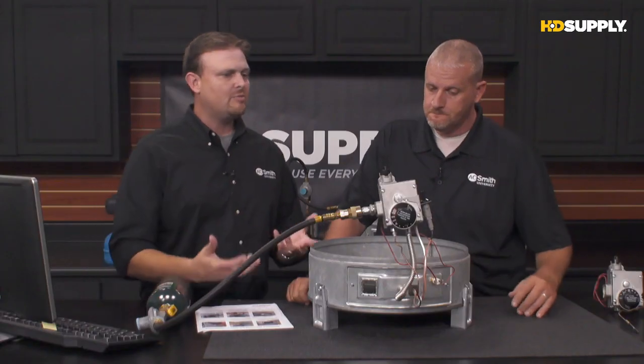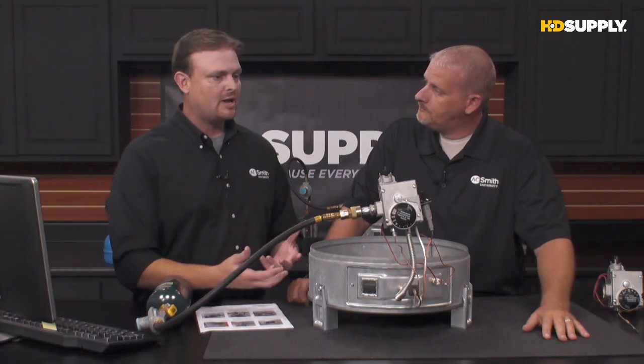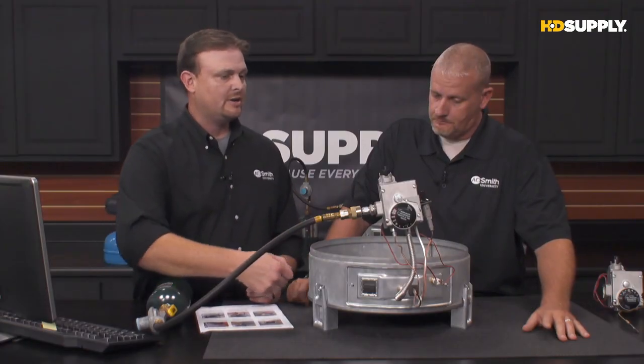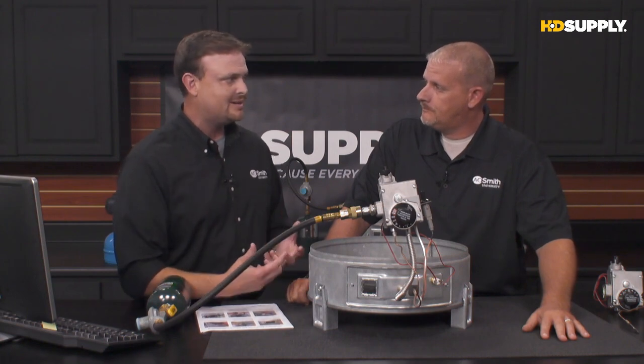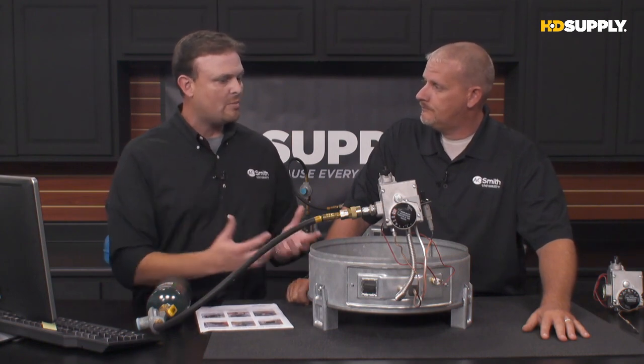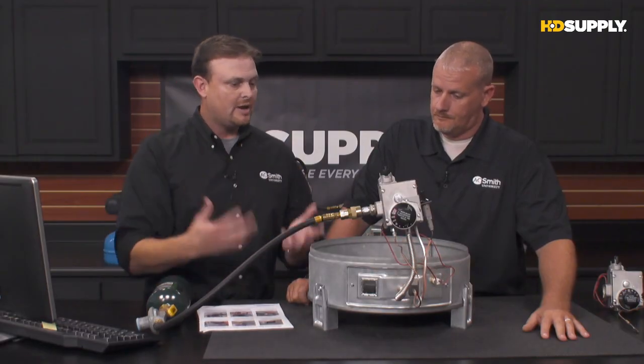If that happens, then you know it was tripped and now it's been reset. Okay, but let's say for our purposes we try to relight it, and we're holding it down, and we release it, and it goes out, and I press the reset button, and it didn't click. Where am I going with that? I mean, the thermal switch never tripped.